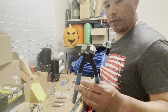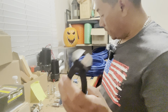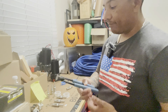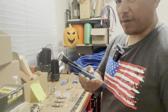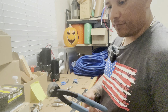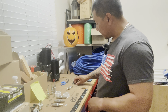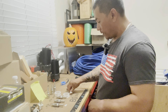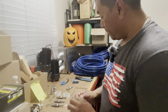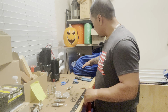This is a tool that you are going to need: these are crimpers — your ear clamp crimpers. Like I said, if you don't want to build your own hoses, these things can range about ten to fifteen dollars. It's a nice tool to have if you go through hoses a lot. We're going to be using a total of six ear clamps.